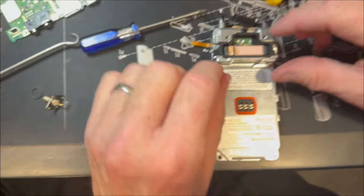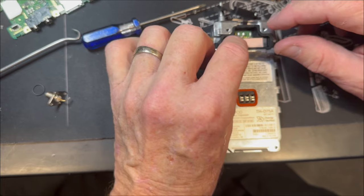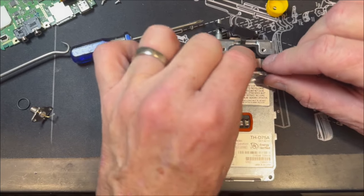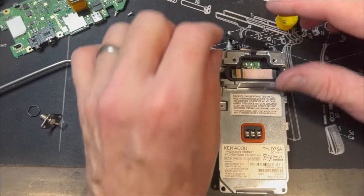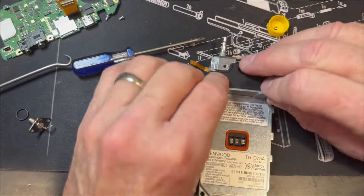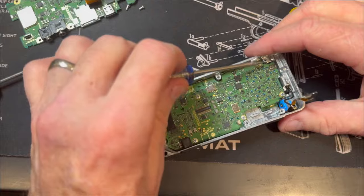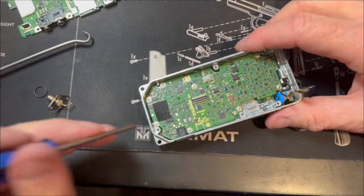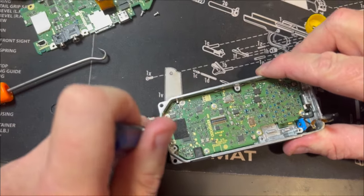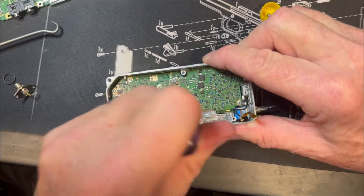Before we make the last important connection by soldering the antenna connector, make sure the bar antenna has been snapped in. It's easier to take the bar antenna off and re-seat it during reassembly so it's all secure. We've checked all our screws and they're all tightened down nice and torqued.